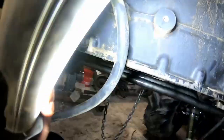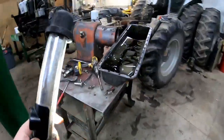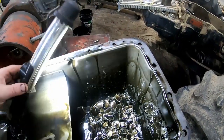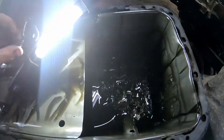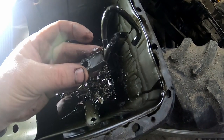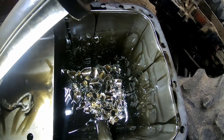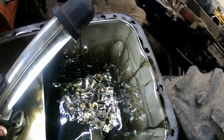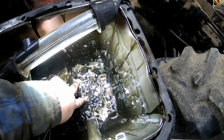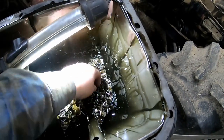But yeah, I would say the sleeve has a lip on the top. I would say it cracked and split and broke off, and so the rest of the sleeve was able to slide down, and as the rod came around, it just hammered the stuff and busted it, and now the noise we're hearing is just the oil jet for under the piston. That doesn't look none too hot. Bolt's probably sheared off in the block on that. And then the next thing is if one of them did it, how far away from it are the rest of them? Yeah. Some piston rings maybe. There's an oil ring.